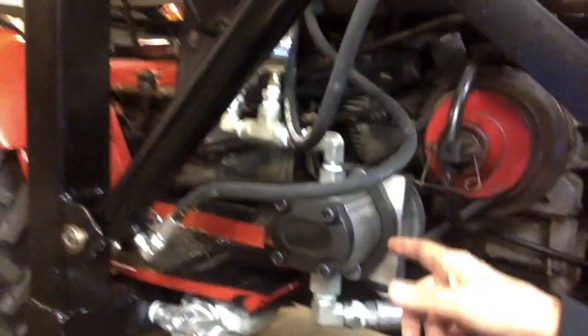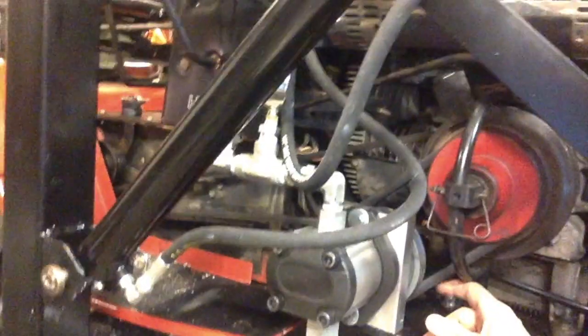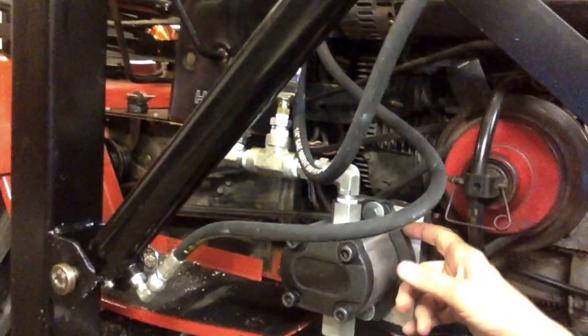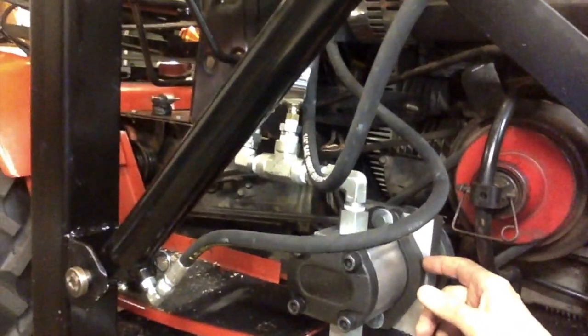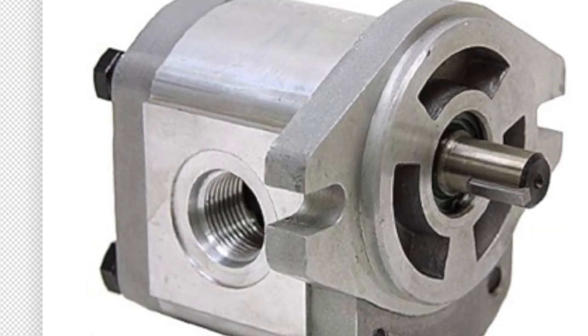But the real trick was not that — rather, the pump itself is not designed, according to the manufacturer, for a V-belt pulley system like this. It's not designed for it: the bearings for the pump are not designed for side pressure. This pump has a 3-1/4 inch hub on the other side of it.